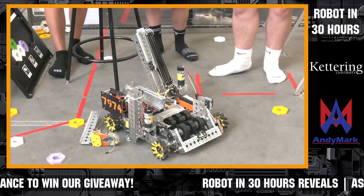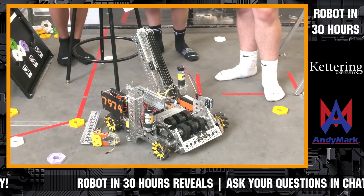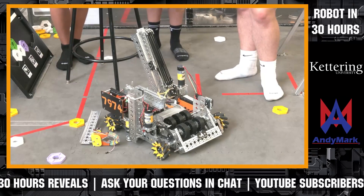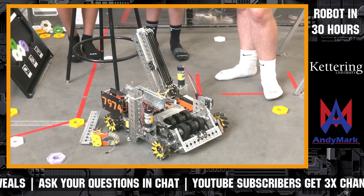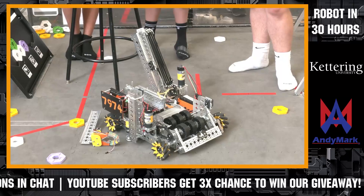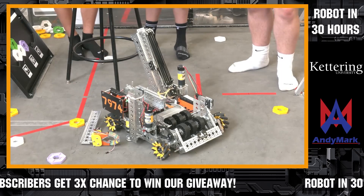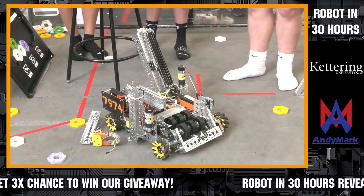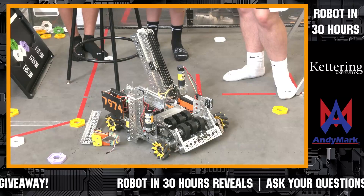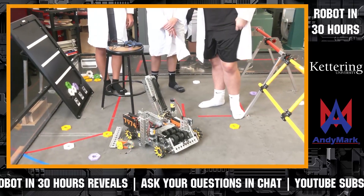To get more specific, we use an 1150 RPM GoBilda motor and then one-to-one bevel gears to transfer all of the power into our intake. Looking at the robot in 30 hours challenge, we are really hoping to pursue the active intake. We believe a lot of teams are going to go passive, and that's going to lead to a lot of time being spent trying to line up pixels. With the active intake, that will allow us to essentially own the pixels — touch it, own it — and be able to transfer to our claw while simultaneously moving to the backstage backdrop.